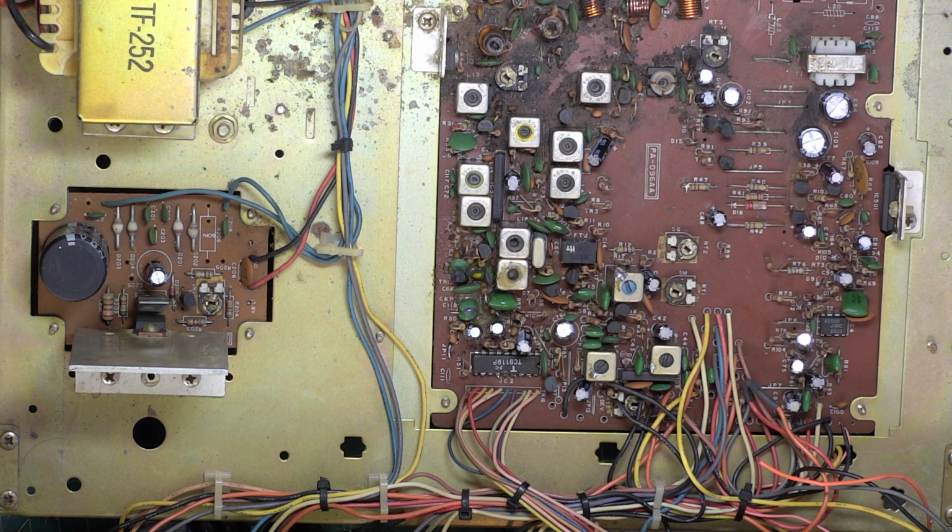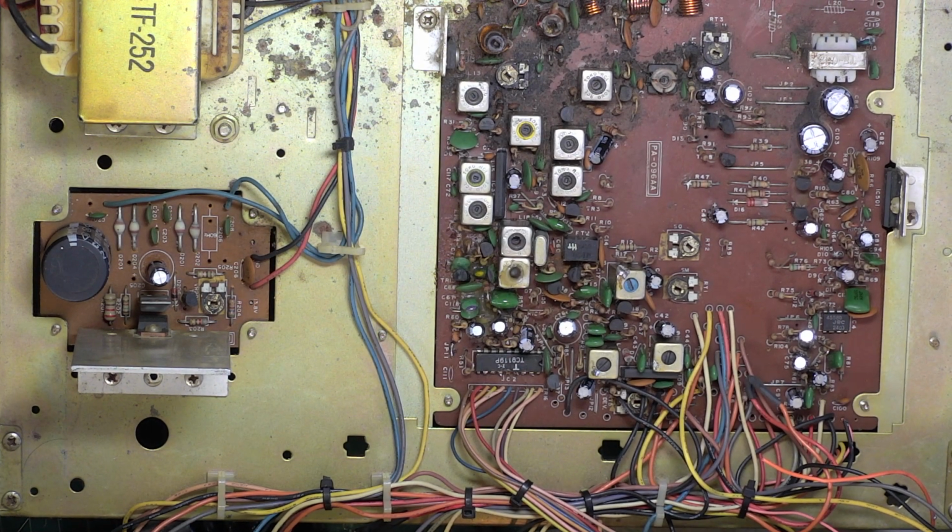Right, so when does the squelch actually open on most sensitive? So now we'll park the signal generator at 0.3 of a microvolt, put the radio to standby. There we are, and open it at. Oh, hang on, I haven't switched it back on. I'll just check that. Right, switch it back on. 3. So 3 microvolts is the most sensitive I can get it. So again, not as sensitive as I would like. Alright, there we are.